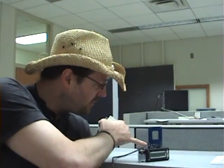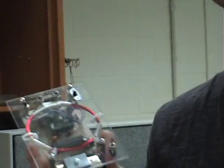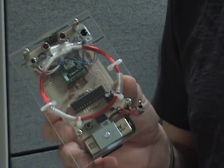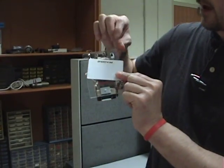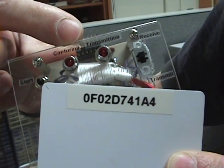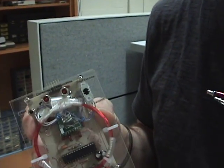What this guy does is basically mimic the previous device. What we're really going to do is actually capture the RFID data and store it in the ATmega168's EEPROM memory. So I take my little tag, place it over the top, press this little button called Start. This little thing says 'Capturing' — lights up — and says it's done. As soon as the LED is off, we're done capturing the RFID card.